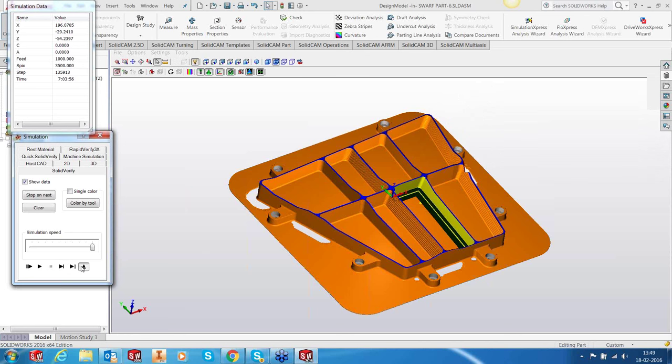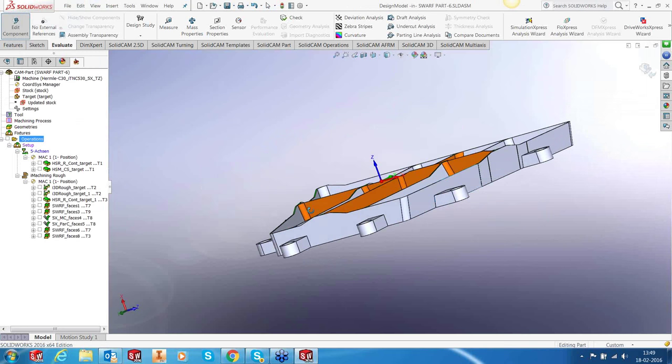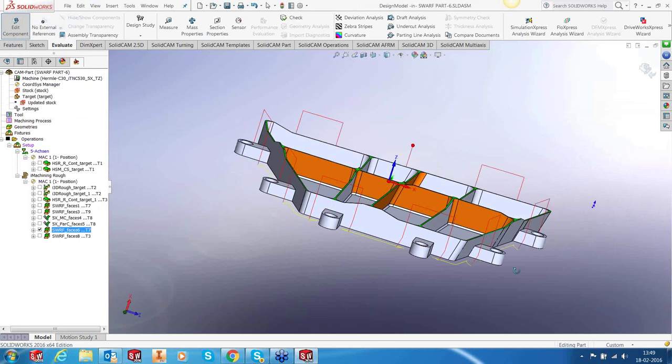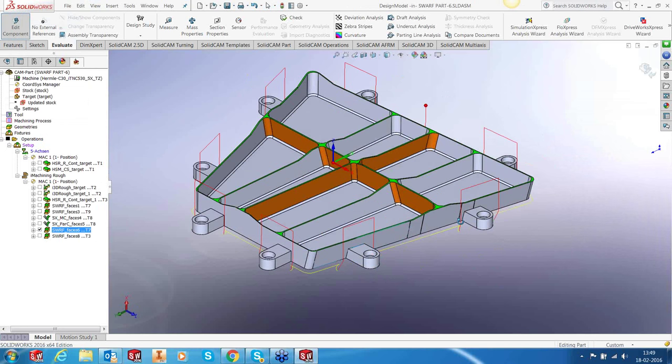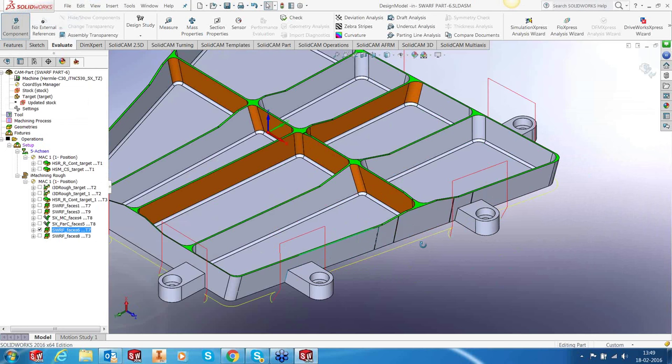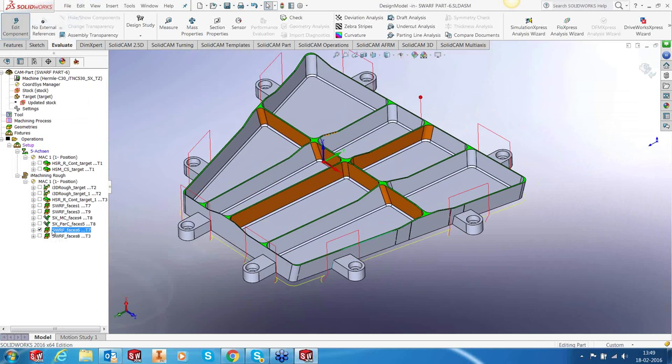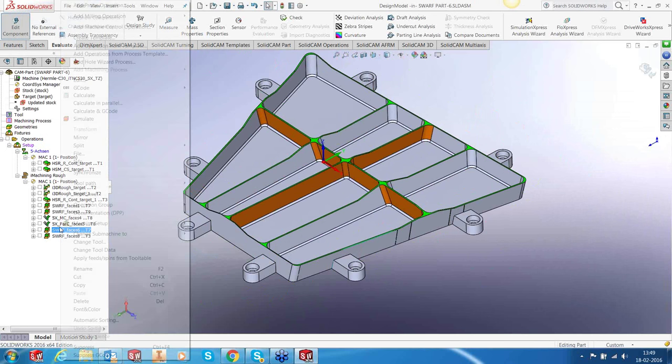Yeah. So, what we have seen, by the way, in the last toolpath out here, I could not show it, but I would definitely like to explain this. Where the tool came here in the simulation, we saw that the tool was trying to align with some other vector, a bit of a crazy vector. Now, this can happen when you have large parts. And the solution here is actually to use a different method in swarfing.